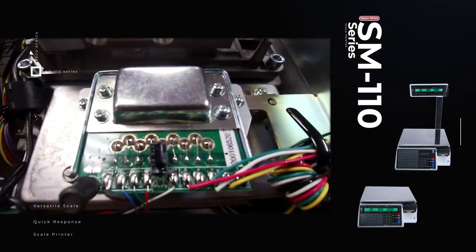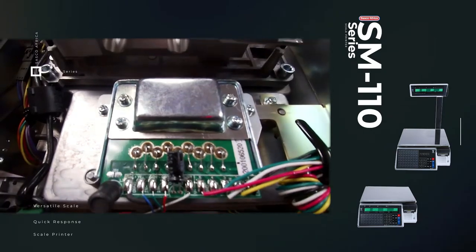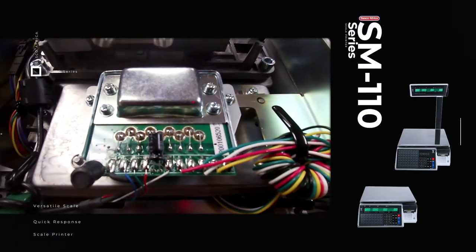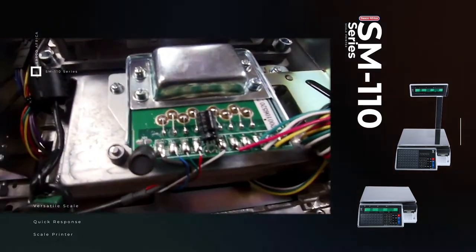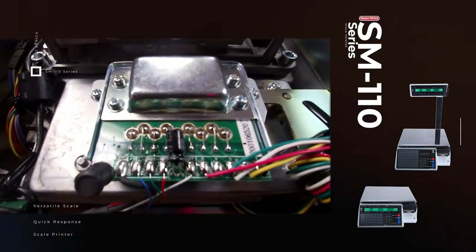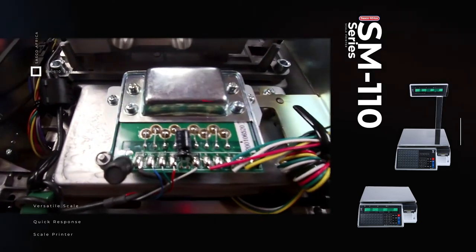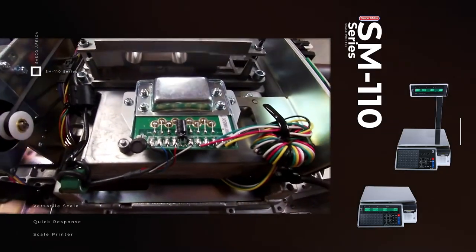Common issues with this are cables that break off, giving you erratic readings that run up and down, or no reading at all. It's not a component that gives too many issues, but if you do have weight problems it's something to look at. You can also connect external load cells on this board if you want to go over 15 kg — for example a platform scale of a ton — the scale is capable of doing this.